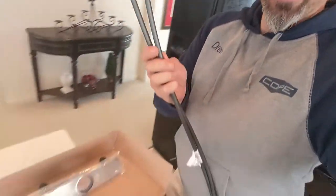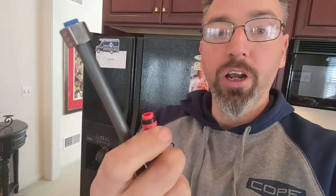If you have an older sink and you're just replacing a faucet and you've already got four holes — because you used to have the handheld sprayer — and you're going to cover three holes with the cover plate that comes with the faucet, and you just want to use the soap dispenser to fill that extra hole, that's fine. Just know that within the first year it's probably going to stop working. Most new faucets come with a three-hole cover plate for retrofitting. For solid surface installs we're usually not going to use that. They also come with a ring adapter for a single hole, a rubber washer, and self-attached ready-to-go supply lines that run right into your 3/8 compression valves. You can cut them shorter if needed, but I tend to just coil them and leave them the length they are.